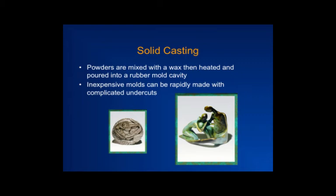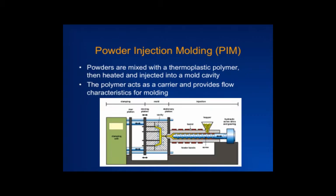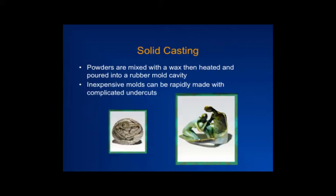A variation of this process can be done with less automation. All you need is a mold and something to melt and pour in. If the viscosity is very high, you need a lot of pressure. But if instead of a high molecular weight polymer, you use something like paraffin wax — lower molecular weight, lower viscosity, lower injection pressure — you can mix the powder with the wax, melt the wax, and pour it into a rubber mold. Wax melts at a lower temperature than polypropylene, and that 100°C difference means you can use a material that can withstand lower temperatures.